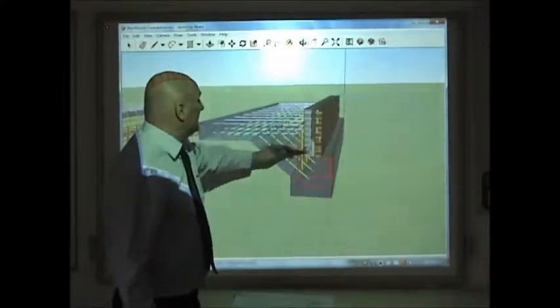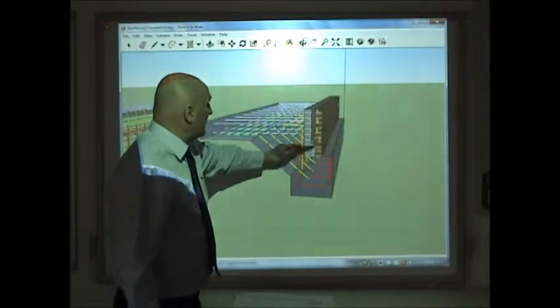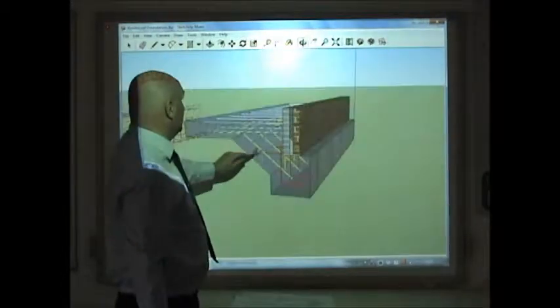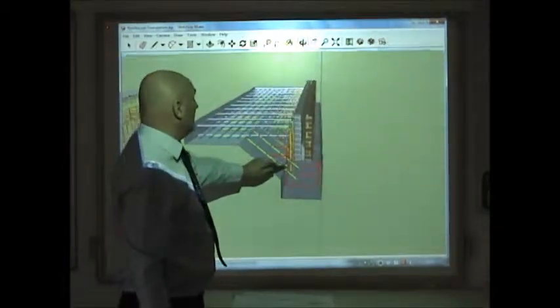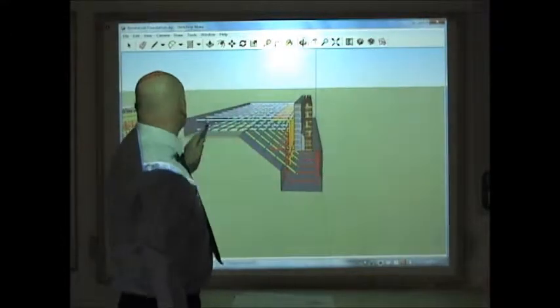We've got our inside blockwork, we've got our outside brick skin, and we've got what we call our cavity fill, and that's to stop the soil from crushing that up on the side there. Now what we would do, we'd go up to our damp proof course, and then we would start our decorative bricks on the top.